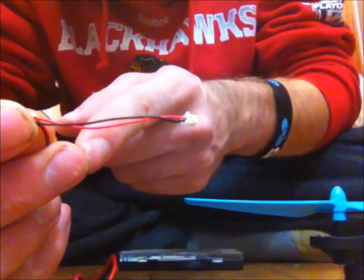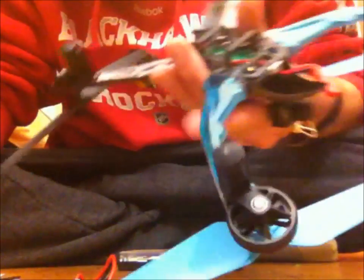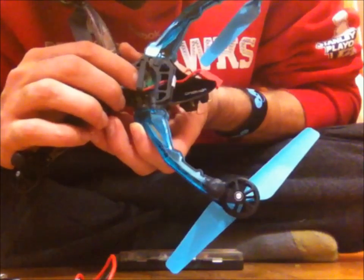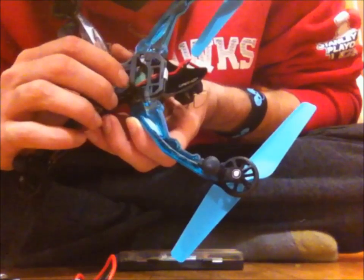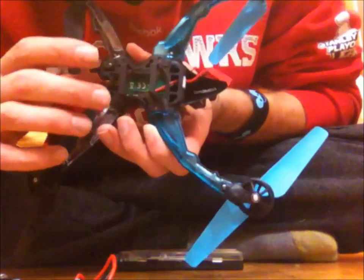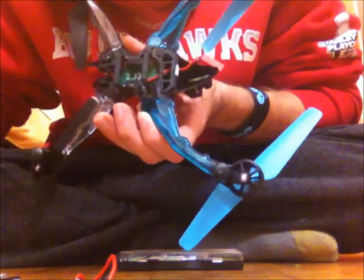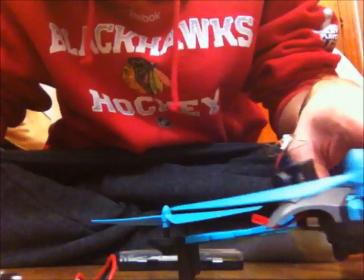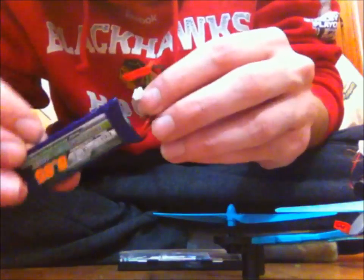I'm going to cut here and then take my power connections underneath my quad, either strip down the insulation or just solder directly to the board, which I'm probably going to stay away from. I'm going to take this plate off and strip down the wires and solder directly to the wires, then insulate them again so I can run both the quad and the camera off the same battery without using this little guy.